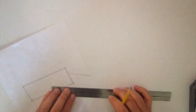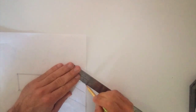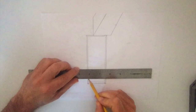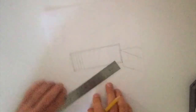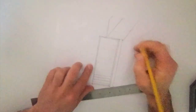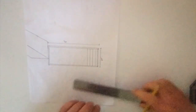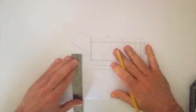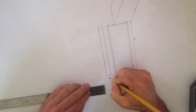What I'm drawing right now is the soffit that is right above where the unit will be. What we'll actually screw into for some strength is that soffit, because the ceilings actually go even higher than the unit. Next we'll draw the bars themselves — we're actually going to be using 3/4 inch black pipe for those. You can see the unit is going to be 8 feet high. The reason for that is that's the height of the soffit, and it's a very standard height, so if I move this to another apartment or house it should fit anywhere. And it'll be 29 inches wide.